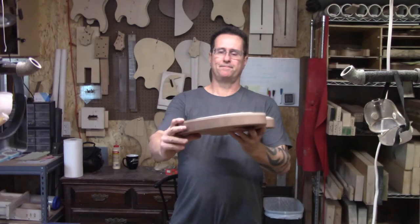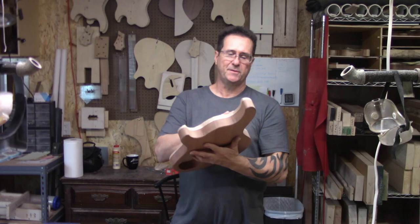All right, that came out pretty good. It's got a pretty nice carve to it — still rough. I'll have to sand this with the DA sander. I'll probably start out with some 80 grit and work my way up, and everything will smooth out and balance out just right.